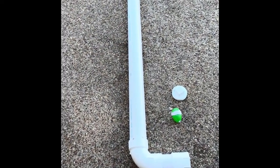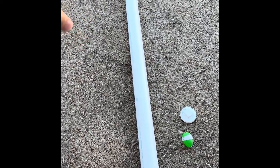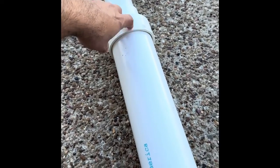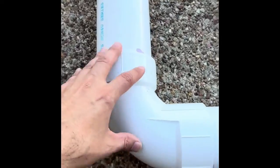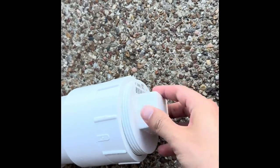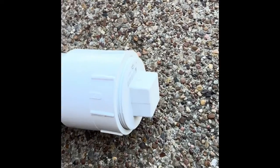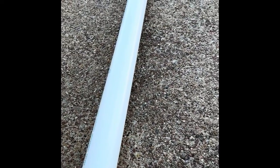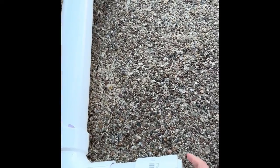Here's my first flush diverter system laid out. The top pipe is your two inch pipe which is going to connect to my existing system right up here. It goes down into a reducer, going from two inch to three inch, and this is all three inch pipe here. Then I come down with a 90 on here, a little piece of three inch pipe, and then a connector I still need to seal on. At the end is just my cap which I can screw on. A lot of people on YouTube with this kind of system unscrew this to control the amount of water coming out — so instead of it sitting in there, it slowly drains out over time.